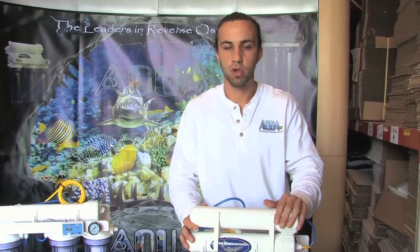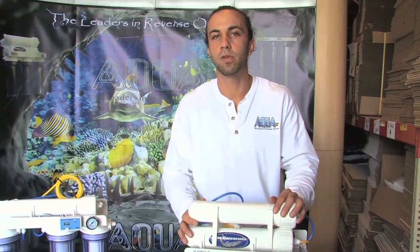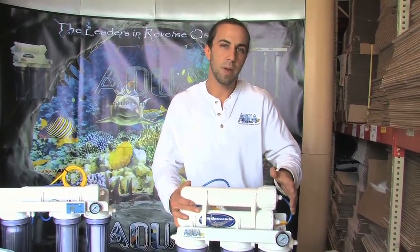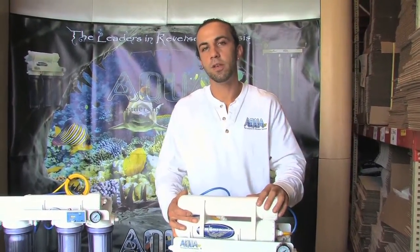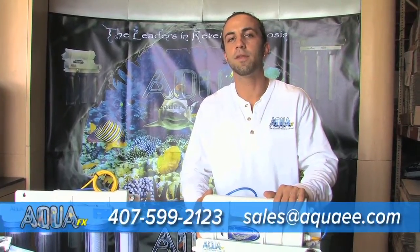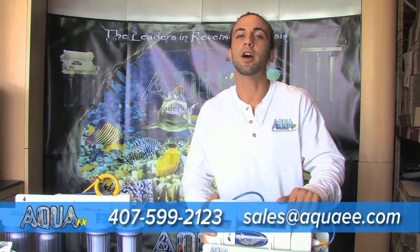You're going to need at least 60 pounds of pressure because as you pass through the first membrane, you lose about 10 PSI. So if your system is operating between 40–45 PSI, you'll definitely want to include one of our AquaFX booster pumps. This has been the installation of the piggyback membrane in series. This will yield your least amount of wastewater and double your production. One thing to note is that the second membrane receiving the wastewater from the first membrane may fail a little sooner because it's receiving the concentrate, but that's okay given the wastewater savings. Any questions about this setup or the parallel piggyback setup, please call us at 407-599-2123, or email sales@aquaee.com — that's A-Q-U-A-E-E dot com. Thanks guys, have a good one.